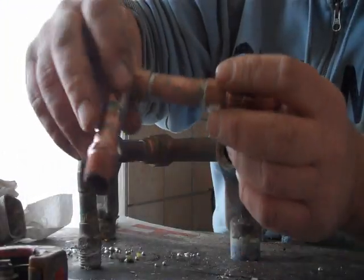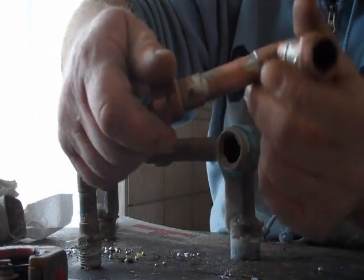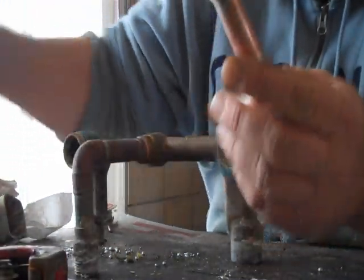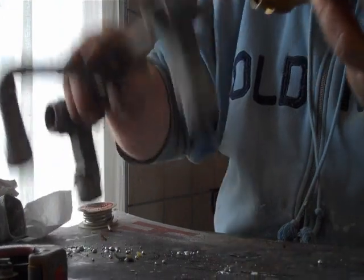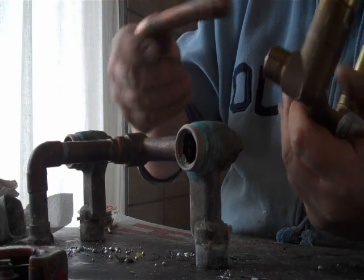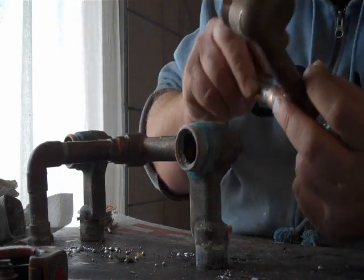All the joints are done. I cleaned it up a little bit — if you want to make it look pretty like a union pipe fitter, you can wipe that stuff off while the solder is still molten. But nobody's ever going to see this; it's behind the wall. Just inspect all your joints and make sure there are no big gaps. There's the old one, and there's the new one. So if you get into an economic situation where you can't hire a plumber and you've got to solder some copper pipe for your preps projects, now you've got an idea how the process works. See you next time.